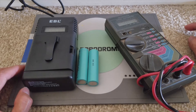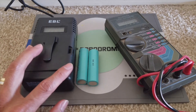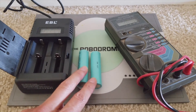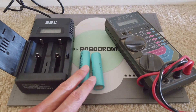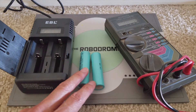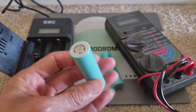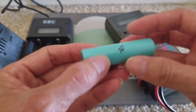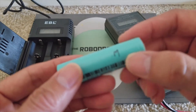I have been using this to charge my lithium-ion batteries to test them out, and I was kind of surprised. I have 6 of these batteries that I pulled out from one of the DVD players I had a long, long time ago — probably about 5 or 6 years or even longer. When I broke open the battery pack, I got these 18650 batteries. I marked them, writing A and B on them, and both measured around 0.17V.